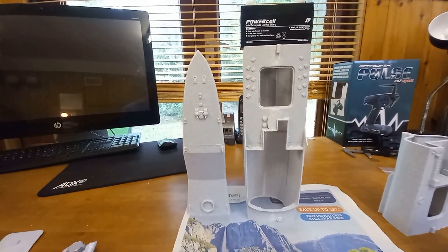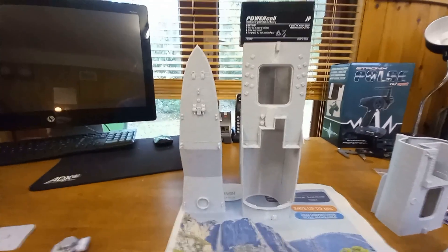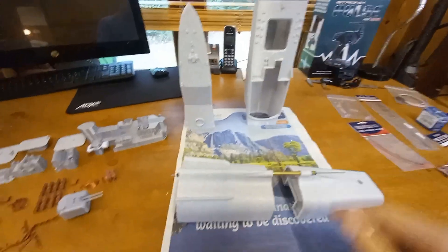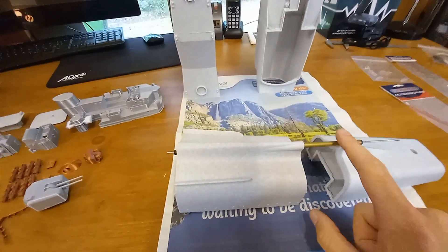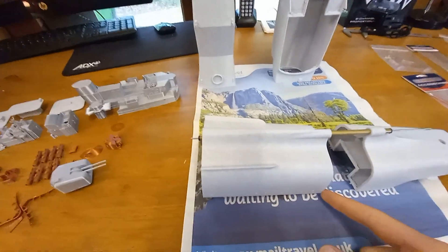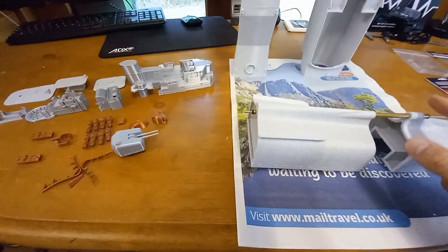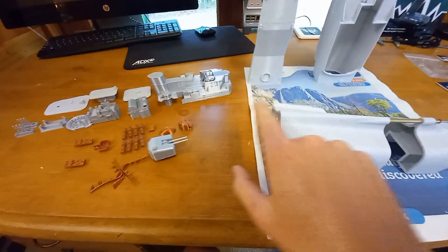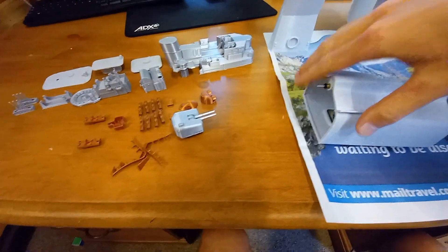After sanding, you're going to want to stick hull piece one and two, and hull piece three and four together. Unlike hull pieces one, two, three and four, for parts five and six with the prop shaft in the hole, you're going to want to apply the glue and attach them together. Once they're attached, slide the prop shaft forwards a bit, apply some glue on this end, and slide it back into the hole so it's more or less flush with this panel here.